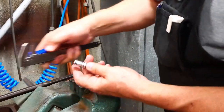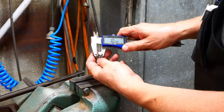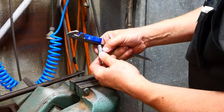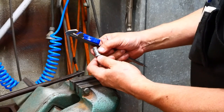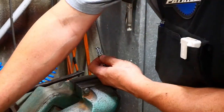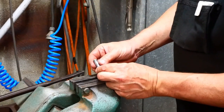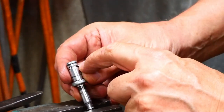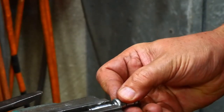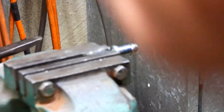What we can see is this piece is about 11 millimeters, so this will need to be turned down and have a three-eighths - I think 16 TPI, anyway a three-eighths UNC or BSW thread put on there. First thing, we have to get this little spring clip here - you can see it clearly enough - so we've got to get rid of that, and there are any number of ways to do it but this is how I choose to do it.